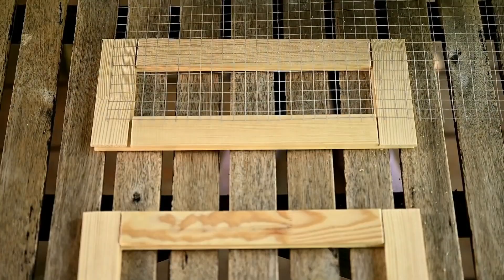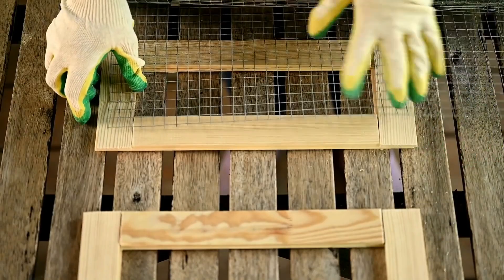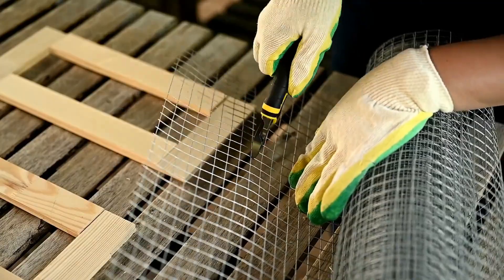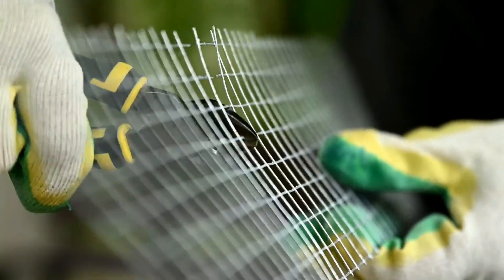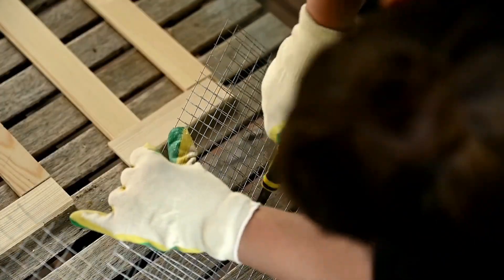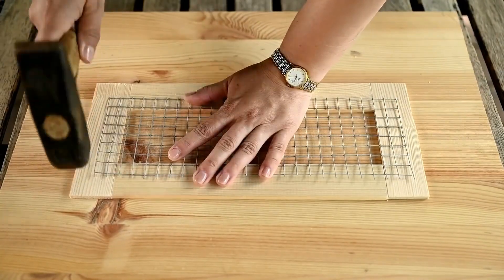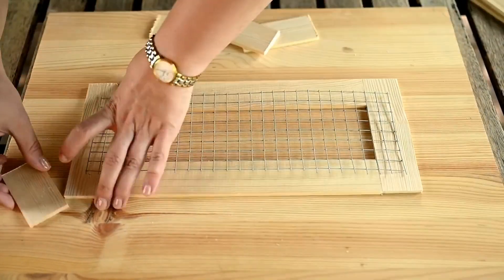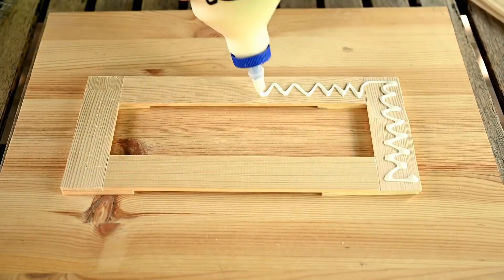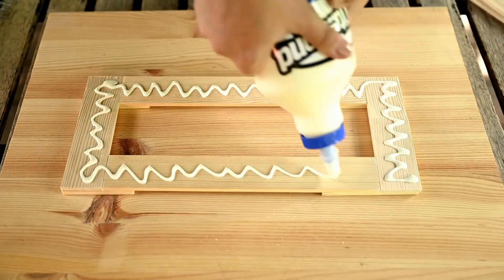I'm trying out the chicken wire on the planks and cutting four rectangle pieces of the appropriate size. The wire should sit between the two layers of planks but not go over the edge. Make sure to wear gloves when working with wire to avoid being scratched. I'm placing the wire on the first layer of planks — it's better to tap the wire with a hammer a little, as the planks are quite soft and the wire will press slightly into the wood surface so the layers sit closer. I'm placing extra pieces under the planks so the clamps don't crush them, and applying wood glue.